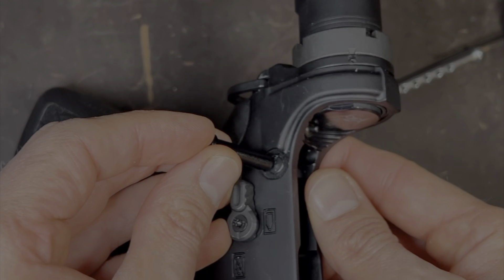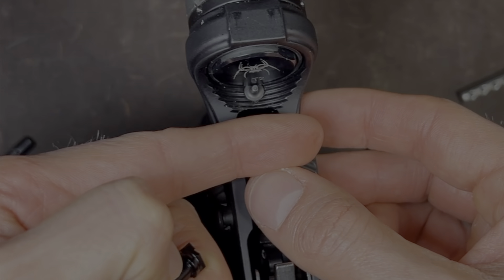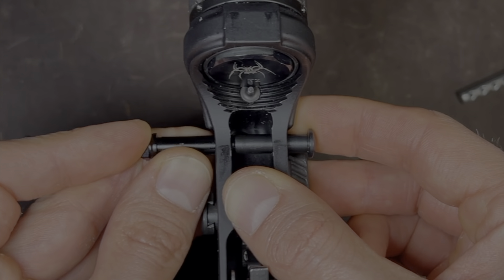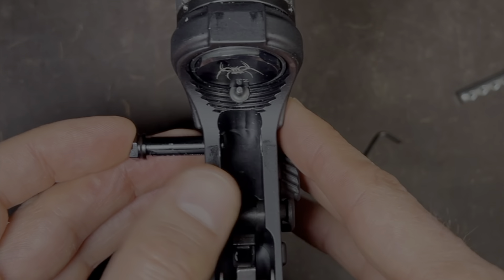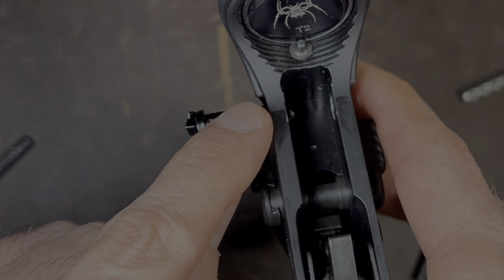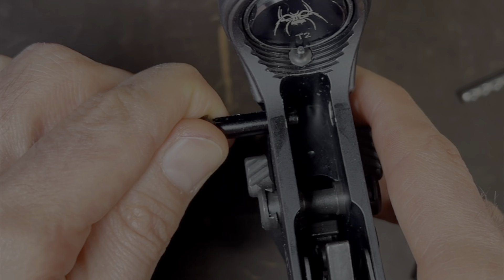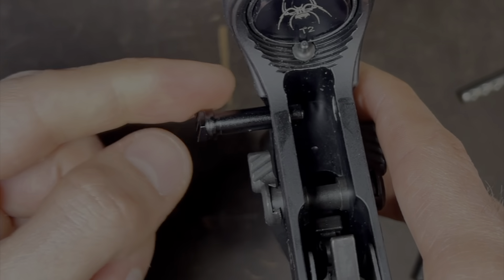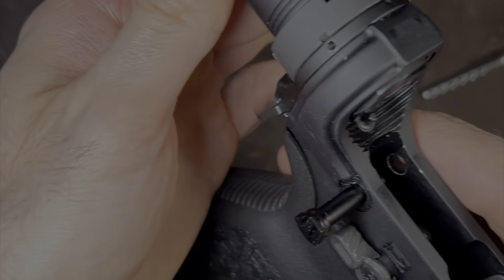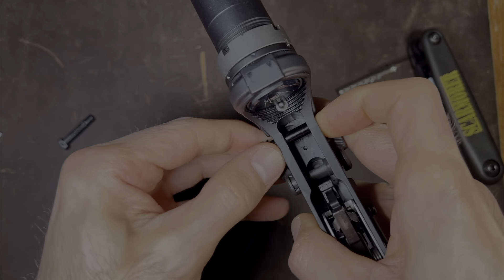Now we can take the new pin and do what we did with the clevis — take the new pin, butt it against the old pin, and push real fast to the right and it should capture the new pin. So now I can remove the old pin — and here's the new pin. We're going to rotate this pin until the detent falls into this channel right here. Turn, turn — you hear that click? That means the detent went into this channel right here and now it's captive again. Boom and boom.